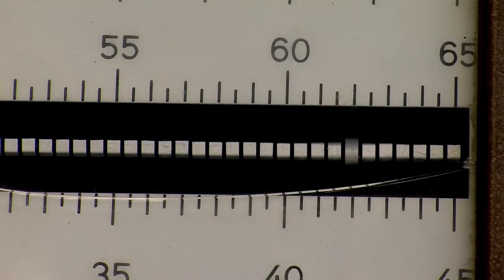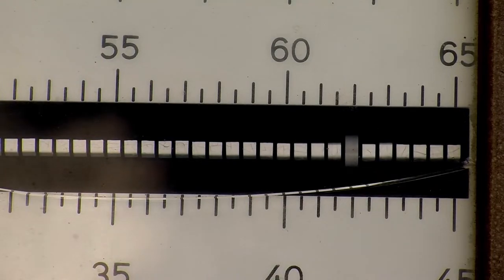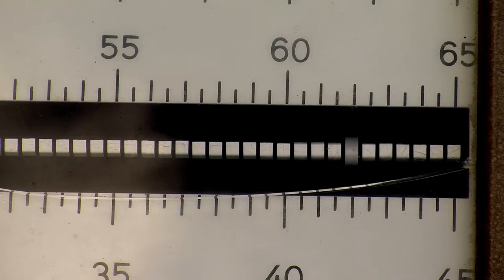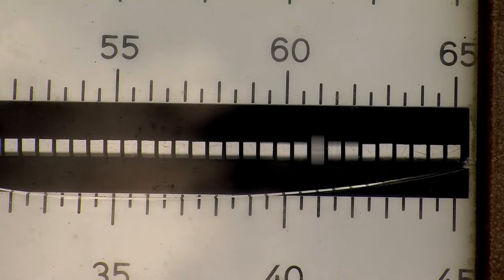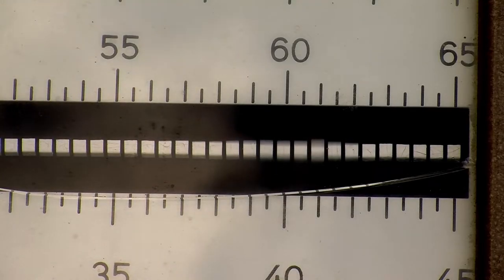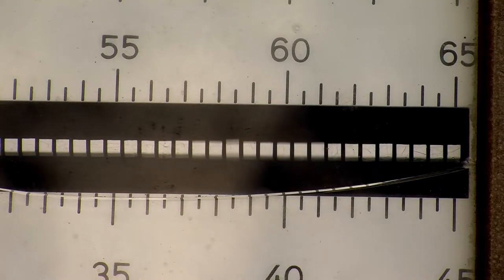There, look at that. It's 62 hertz, almost exactly. And that's not really unsurprising because the generator is typically adjusted to run a little bit too fast under no load, because it will slow down when there is a larger load applied. Now watch what happens if I adjust the governor on it to slow it down a bit. You can certainly see the frequency drop.